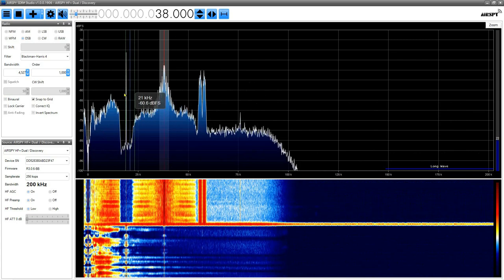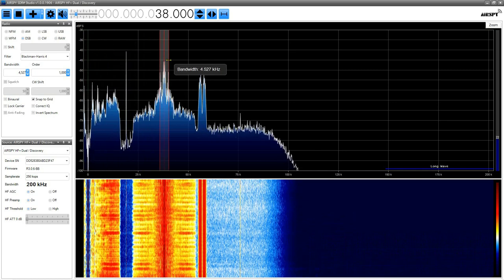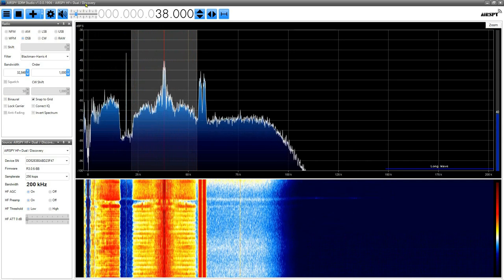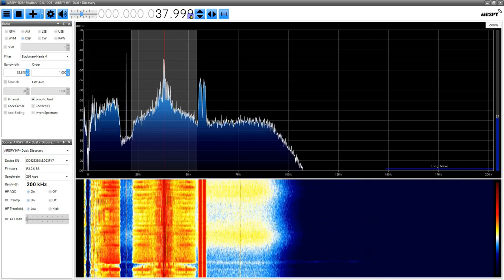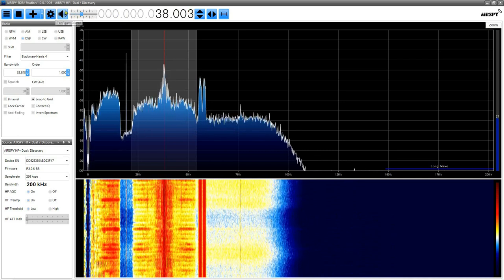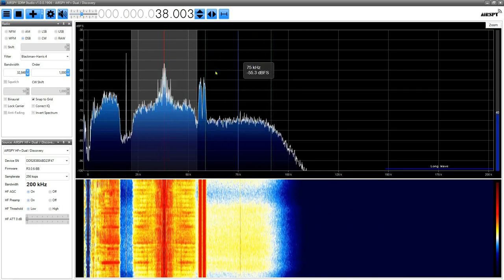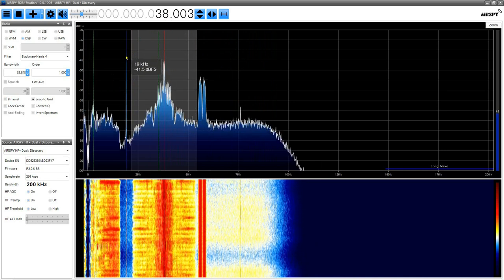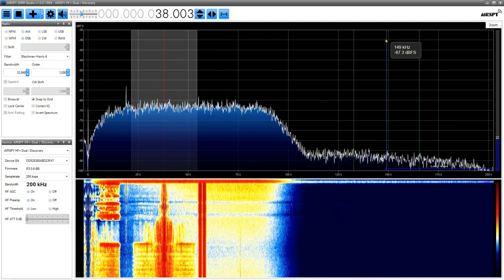Okay, here's another one. Now, again, the mono left plus right audio, and look at the amplitude of this. Now I'm going to pop this open for a second in double sideband and see if we can hear it. You can hear it pulsing. Okay, I'm trying to decode that with the oscillator in this radio that is not exactly 38 kilohertz phase related to the 19 kilohertz pilot. So anyway, that's how we used to do it in the old days.